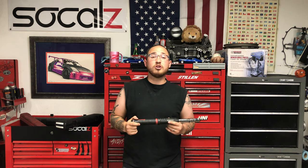Another positive is you will know what torque you went over to if you do over-torque. With a click style, you click and go past it and don't really know where that bolt ended up. With the digital, you'll see: I went to 25 but accidentally went too far — it's showing me I torqued it to 38 foot-pounds. That tells you whether the bolt may have stretched too much and needs replacing, or that you're still within range and you're good to go.